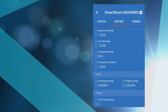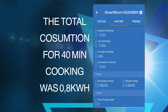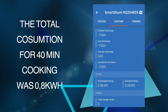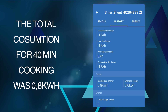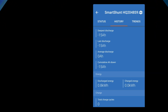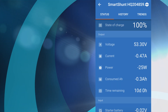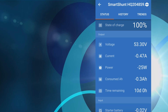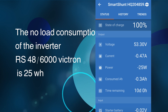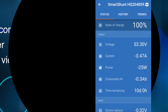I'm going to put some pictures at the end of the video showing how much I drew from the battery. I was cooking for about 40 minutes and the total consumed power was 0.8 kilowatt hours. I peaked out on two burners at 51 amps, or 2.7 kilowatts, and the idle consumption of this inverter is 25 watts. I'm going to enjoy this meal — see you in the next video, goodbye!